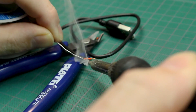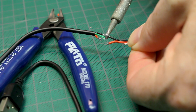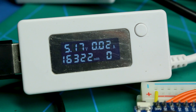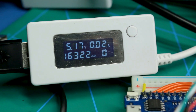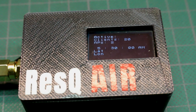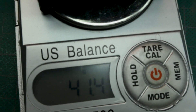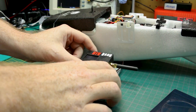For bench testing I decided I better have an easy power adapter — USB is just the simplest way, so I hacked up a USB cable and hooked it up to a servo wire. Now we have power, and surely someone will ask — this is our current draw, fully operational with GPS. We're not transmitting with the ESP8266 radio, we're just passively sniffing, so this should do the job. No significant impact to our battery consumption on our aircraft or quadcopter. The current weight of this prototype is 41.4 grams, with the excess larger enclosure and all the wires. We can get this to be much, much smaller, but for now I think this will do the job.